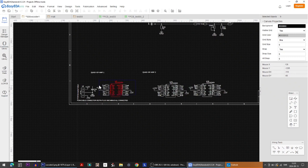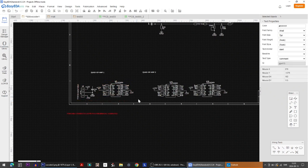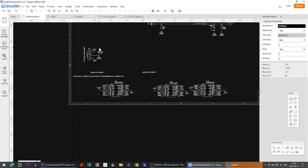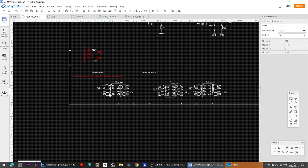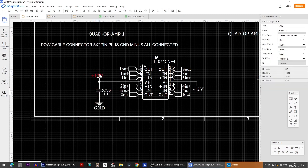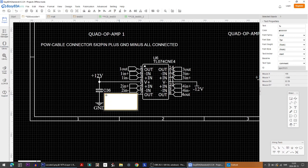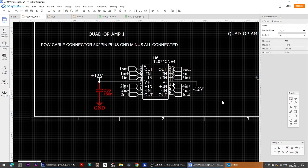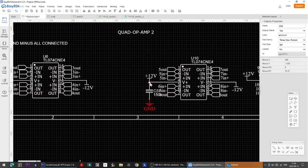Or you know what, let's just do it the other way around, which is like this. Oh, please, how hard can it be? All right, so it's seriously messing with me right now, so I'm just going to put it up here and let's instead take, no, okay, yes, like this. I put this here, so now we have some kind of voltage stabilization going on here, but it should probably be smaller, maybe like 150 nanofarads. Yes, that could be good. So let's just copy this for each of the things right here.